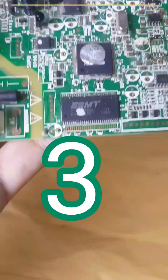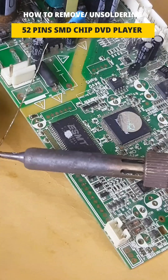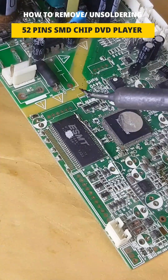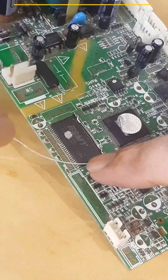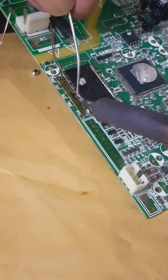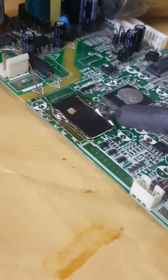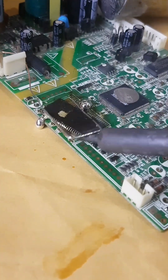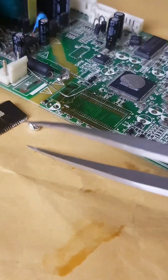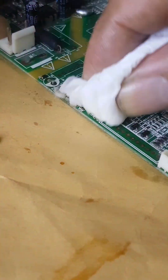What I am showing you is an SMD IC that has 52 pins, located on the main board of a VCD player. I use 0.2 millimeter diameter copper wire that I had coated with tin. I make this wire rectangular along the edge of this SMD chip, and I'm done removing it from the main board. It's quite difficult indeed, but it takes patience to work on it.